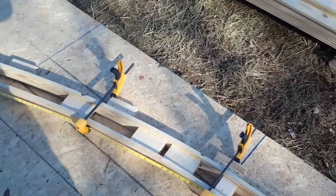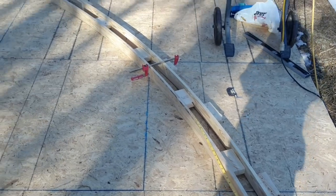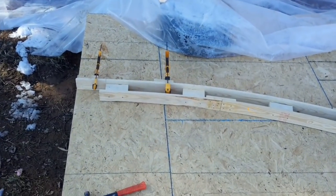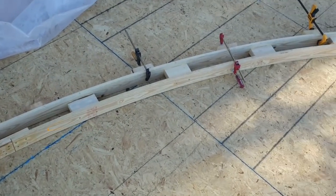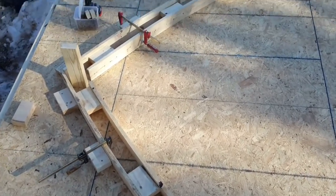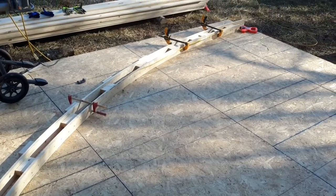I'm back up at the land today for two reasons: one is to show you my progress on the gothic arch, and I'm also going to spray some shellac on the old fiddle. I want to show you what the arch is going to look like. What I've got going on here is a couple of furring strips — up in New England we call it strapping, it's 1 by 4. We made a jig, clamped the boards to the jig to get my arc, added in the little blocks, and it's a completed gothic arch truss. Now I'm going to head up to that little tent building — it's all I've got to work in. My wife won't let me spray shellac in the camper.